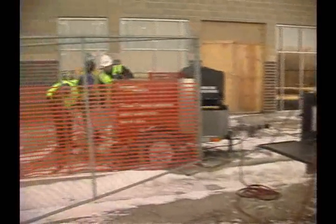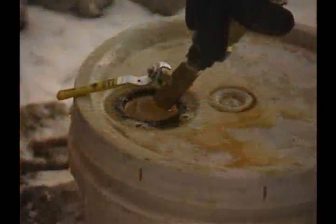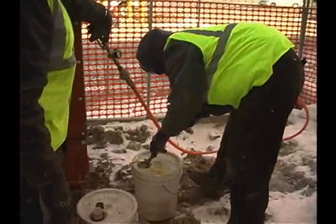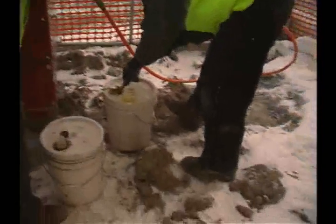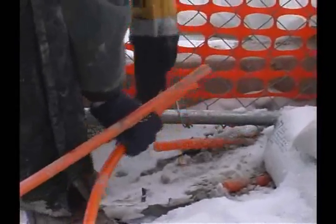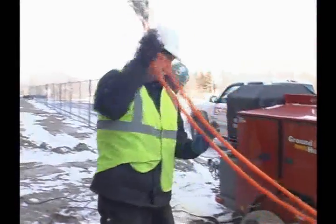It's pretty simple. Just hooked up the hose to a small air compressor, hooked it up to both lines and put about 60 pounds of pressure in the tube to blow the glycol out and recover what's left in the hoses — pretty simple. After this we take the E1100 back, fuel it up, and out to another job to do some ground thaw with it.